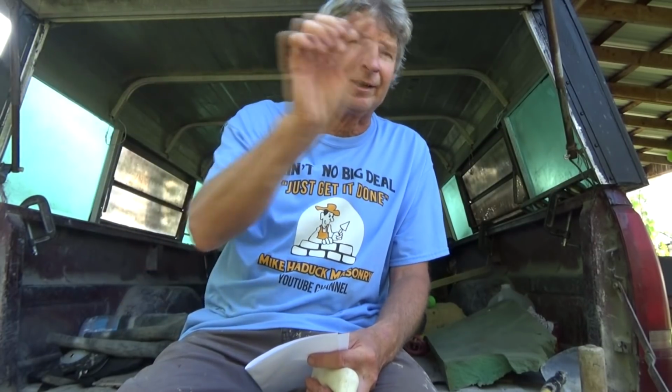So I'm going to talk about the job a little bit. You've seen the guy rubbing it down with the brick. Usually when you plaster like that, you plaster the whole foundation with traditional cement, then you wait 30 days. Then if you get any cracks, you got like a little tape and you go over it again, and if there's any roughness, you rub it down with a brick.